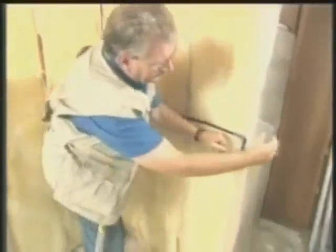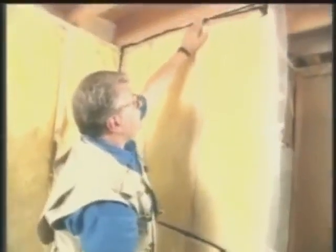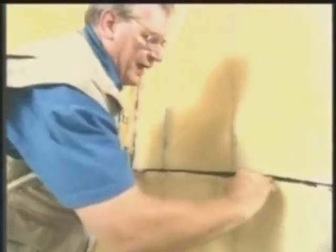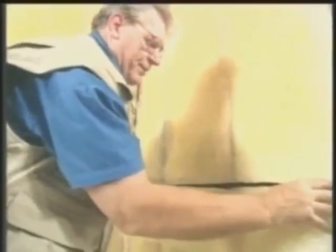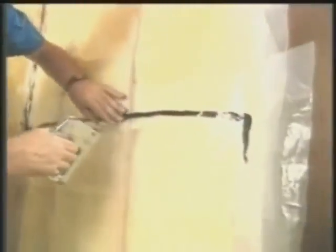Now here's where the polyethylene vapor seals come down under the wall, up and terminated at this point. Now we've added vapor barrier to the top of the plate. We've sealed it in with acoustic sealant caulking down and overlapped 1 foot. Also put the sealant to seal that seam, that way giving it a good tight vapor seal. Now all we have to do to finish this wall off is staple it. And always staple right at the point of the acoustic sealant, as you can see here. That way it squeezes nice and tight and it seals it at the point of where the staple is.